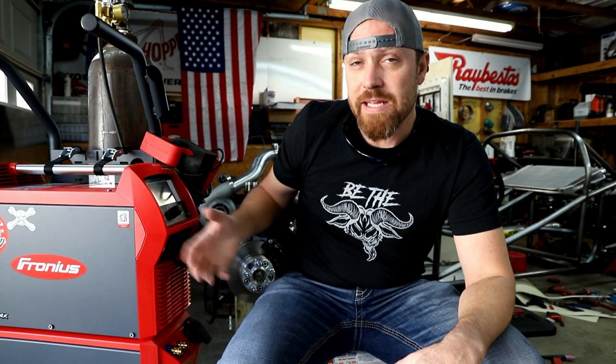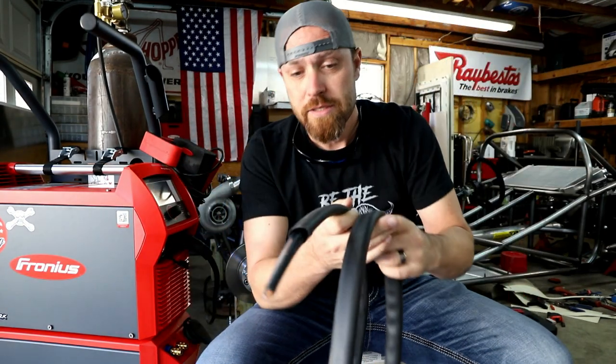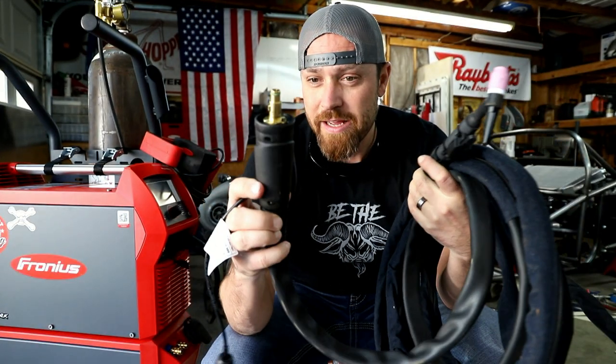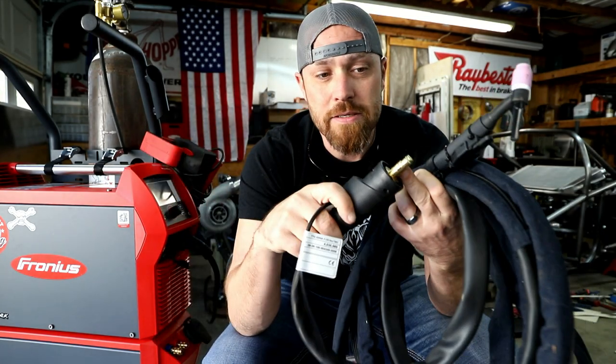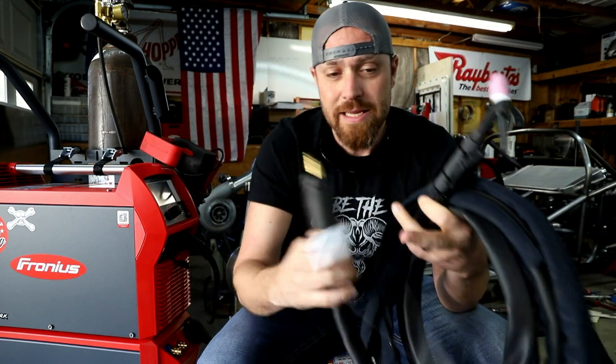Before I jump straight into the CK setup — in the past what I've done is I've kind of cannibalized one of the Fronius torches and another torch and combined them to make something more Americanized, more standard, but with all the Fronius fittings so it would work properly. Basically I took a Fronius torch, cut the end of it off very carefully, and merged it onto another torch. This is a 25-foot standard style Number 9 torch, not water-cooled, with the Fronius gas-through Dinse connector so I can use the trigger. It worked awesome.